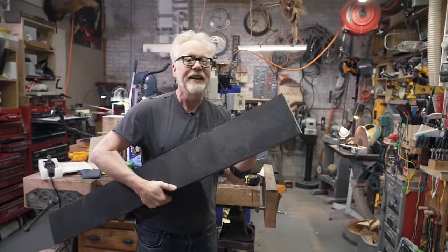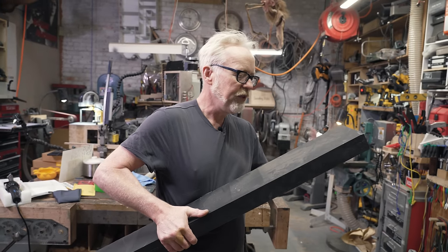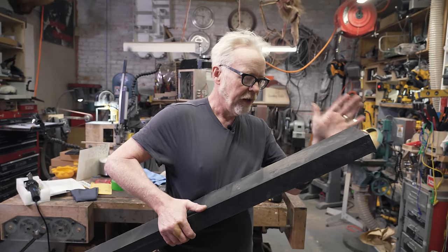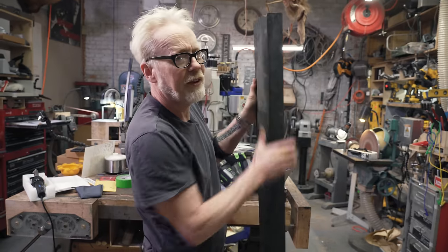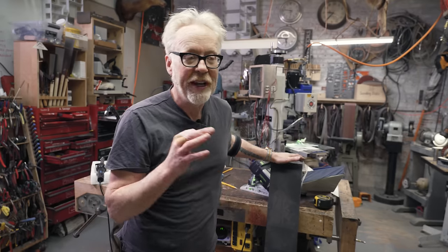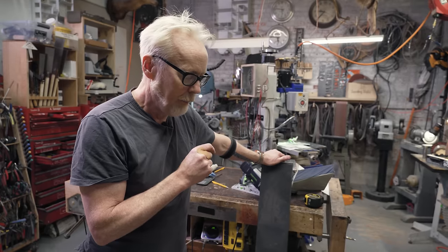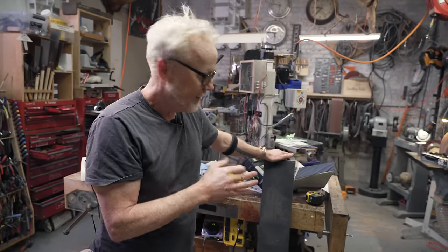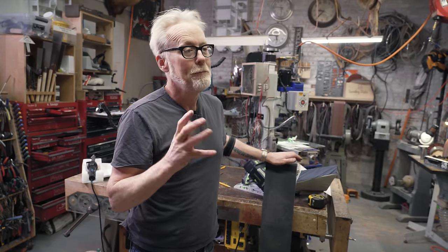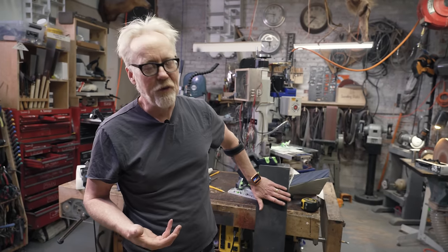material for anything, and it's Richlite. This is an industrial material built originally as lab table material. It is a resin-infused paper, layers and layers of paper infused with resin, sort of like a micarta. It's dense, it is structural, so you can actually build structural things out of it, unlike many machining materials. It's expensive, but as you can see, it already comes in this beautiful warm black, and you can finish it to a nice satin smooth finish. It can be beautiful. So this will be the base of my phone display.